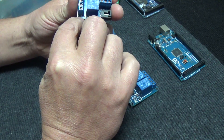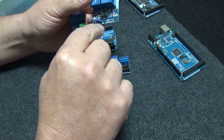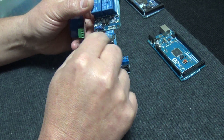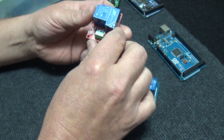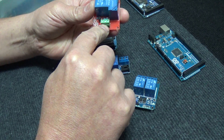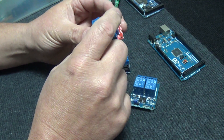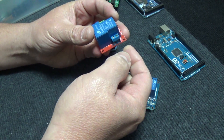If you look on any of the boards, they'll tell you which terminal does what. This one is a dual relay so it has one relay, two relay, voltage to power the board, and then a ground. These things typically switch on ground, so you'll have a ground, a control, and 5 volts. If you go 5 volt high, it's not going to do anything — you go 5 volt low and it's going to activate the relay.